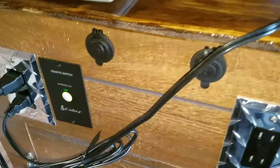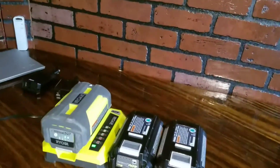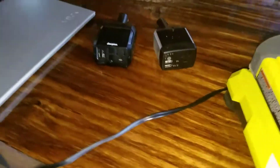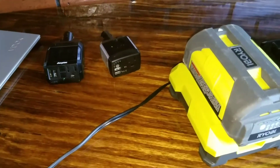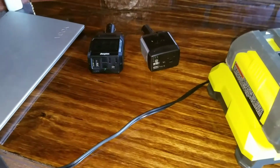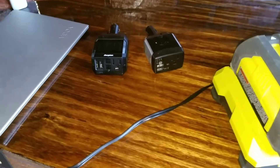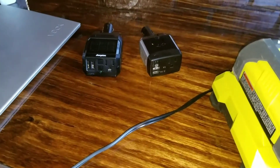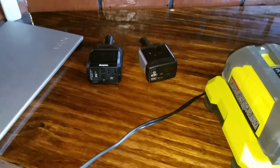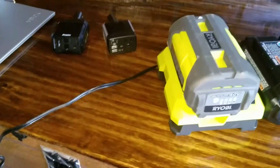You wire that to one of these 12-volt ports, plug in one of these small inverters, and then you've got power anywhere you've wired up for 12 volt — you're done. That gets you power to what you need. A lot of people in smaller shed homes, campers, and RV setups can run solar and still have the same amenities as home. For example, you can do a rechargeable vacuum that you plug into 110, recharge it, and run it just like normal. It's not sucking too many amps like a normal house vacuum — that's where regular home vacuums kill you, the amperage on them.